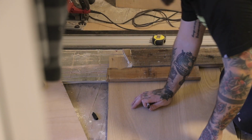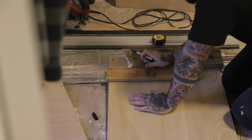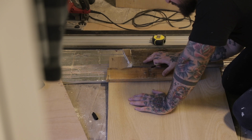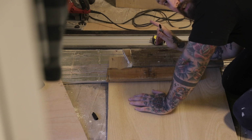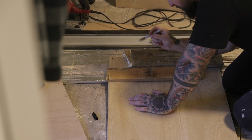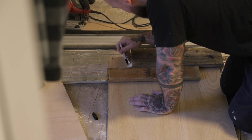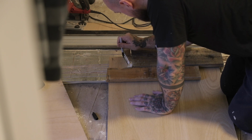I've got to the trickier of the cuts now. The first one obviously just needed the corner taken off nice and easy, but this one needs cutting around that beam. So I've laid the template on top, taking into account for the fact that we've added insulation and plasterboard to that ceiling, so this can't line up with the top of this because the ceiling's now lower, but hopefully we've got this roughly right, and I can draw around this roughly anyway.